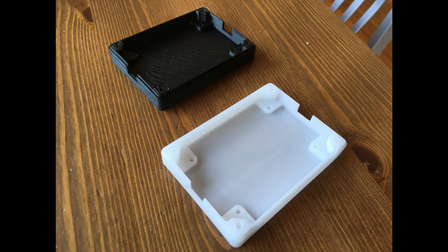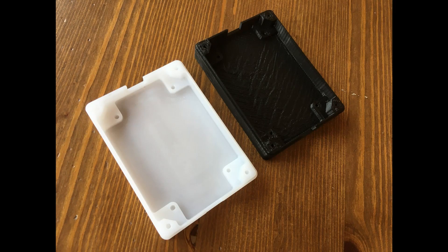It's also easier to get the screws in. What I found is I just needed to mill the case to have the diameter of the drill that you would use before tapping. Then rather than actually using a tap, you just screw the screw in directly to the plastic and even the fine machine threads will cut into the plastic and basically form-tap the thread for you. They end up being quite secure.